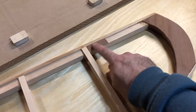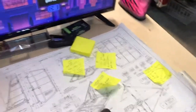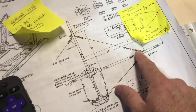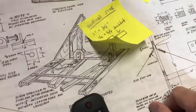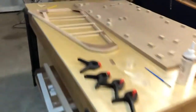What these do is they act as a filler and a support point. There's another one here — let me show you on the other side. These act as a support point to bring the surface flush again with the vertical stab here, so you can put the brace bracket with the wiring to go down. There's a rabbet in there, and to bring the surface back flush, you've got to put that little gusset in there. And then the brace goes against that.